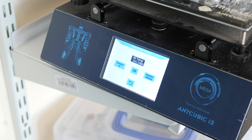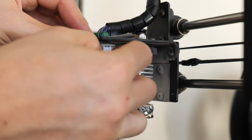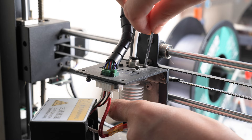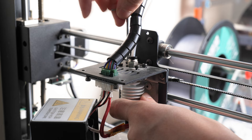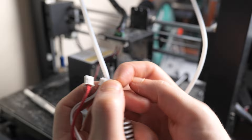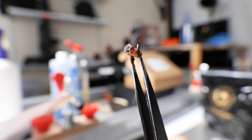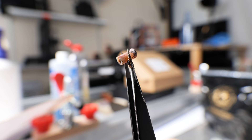So let's see if we can take this apart and clean it. Start by preheating your hotend and removing your filament. Remove the outer hotend casing and unplug the heater cartridge and thermistor cables - take a picture to remember where they plug in. Unscrewing the top four screws will allow you to remove the hotend from the housing. Pushing down on the quick lock connector, pull your Bowden tube out of the hotend. You can see that mine has burn marks and the PTFE tubing has actually deteriorated. This is one of the downsides of PTFE-lined heat breaks - PTFE over time will begin to break down and off-gas harmful fumes. The geometry of the inner diameter of the tube also can deform and cause resistance in the extrusion process.